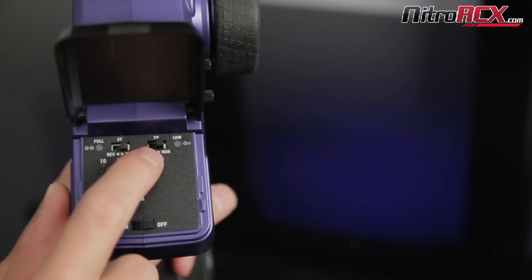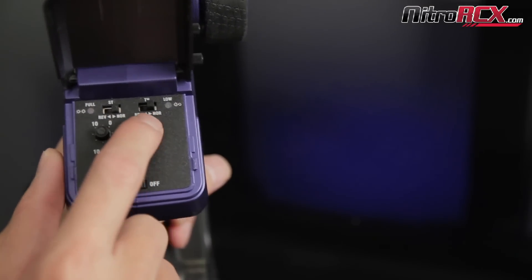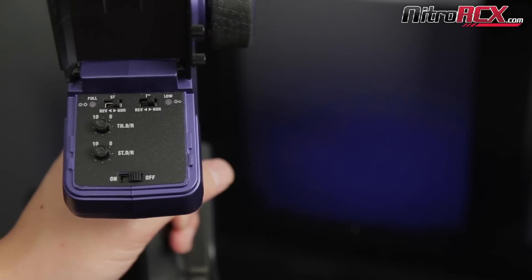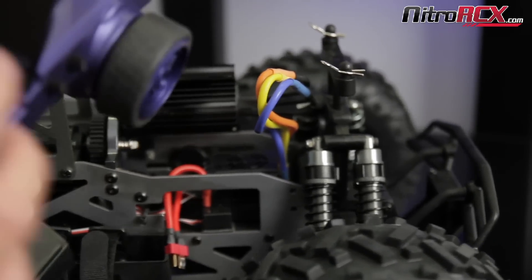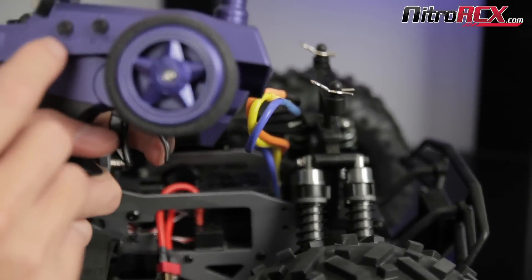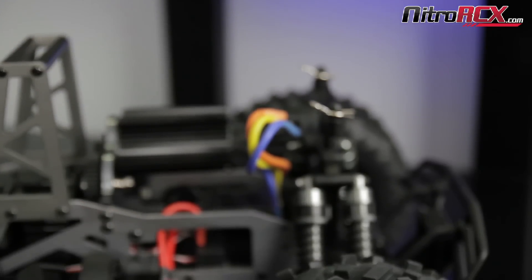There are a couple of ways you can do this. You can reverse the throttle on your transmitter. When you do that you can see if it's going the other direction. If you do that, you want to be careful to make sure your throttle trim is centered so that when you reverse it, it doesn't go full throttle.